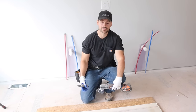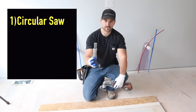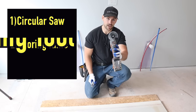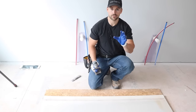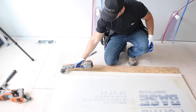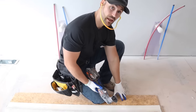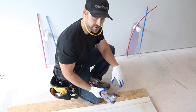There are a couple of tools you can use to cut cement board: a diamond blade on a circular saw, or a scoring knife — though that creates a lot of cement debris. The best tool I've found is an oscillating tool; it doesn't throw up much dust or cement crumbs. Always wear ear protection because it can be really loud. Also, place scrap plywood underneath so you don't cut into your subfloor.